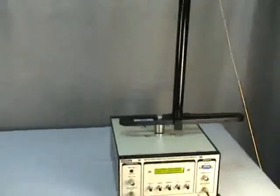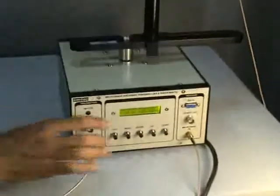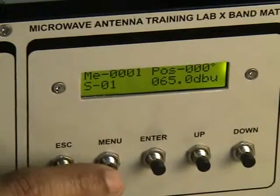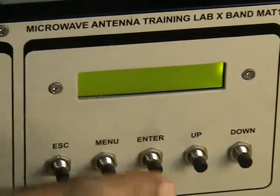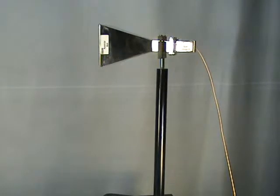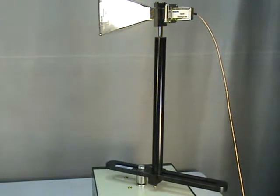In this setup the antenna is ready to rotate and the azimuth pattern can be plotted. Using the menu control, one can select memory, step size, and manual or auto mode. Selecting auto mode and pressing enter causes the pyramidal horn at the receiver end to rotate in steps of one degree. There is also a phase centering adjuster which makes the antenna rotate from its phase center.